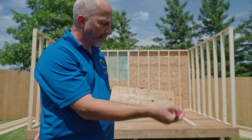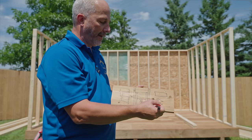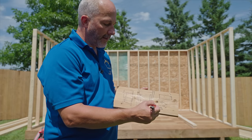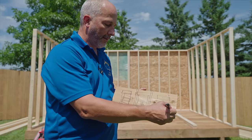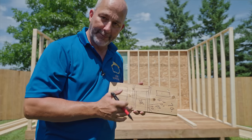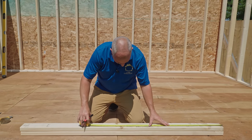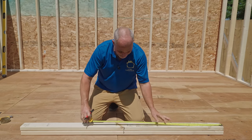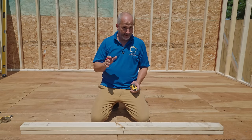At 16 feet, that's 192 inches, minus 38 for the door, gives me 154 — wait, 192 minus 38 is 154, cut in half is 77 each side. We need top and bottom plates at 70 inches — we'll mark our center line at 35. I have a window available off the shelf at Home Depot, it's an 18 by 20.